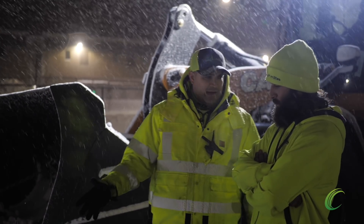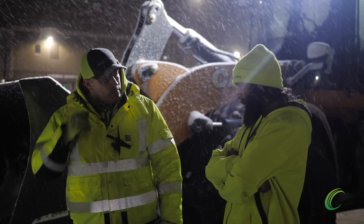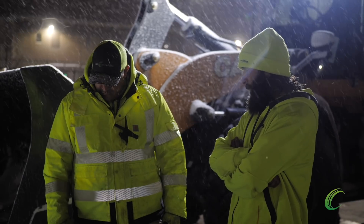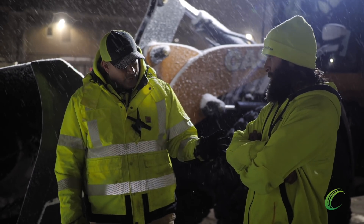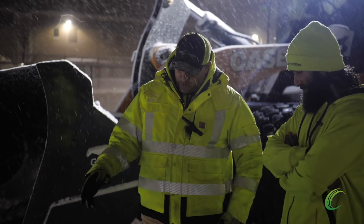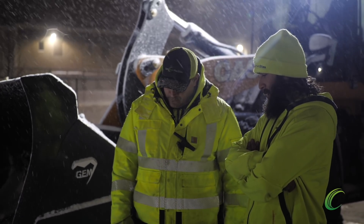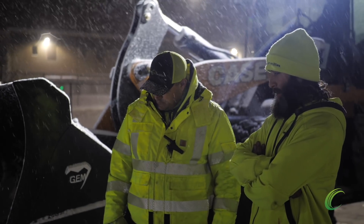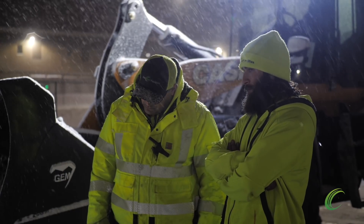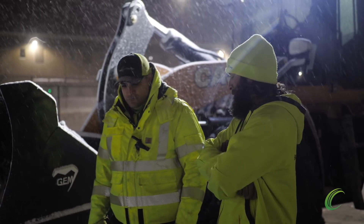How do you feel that these boxes work? They work better than anything I've ever used for clearing snow. The cutting edge on the bottom is spring loaded, so when you hit something you're not going through the windshield of the machine and you're not ripping the cutting edge off the bottom. The cutting edges give way, and that puts a lot less wear and tear on the actual box itself — you're not jostling every component around. The only thing that will be moving is the bottom cutting edge. When you hit a small lip or bump, they fold back and reset themselves as you continue on.